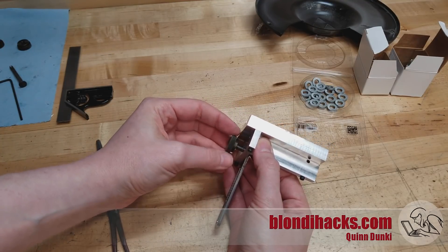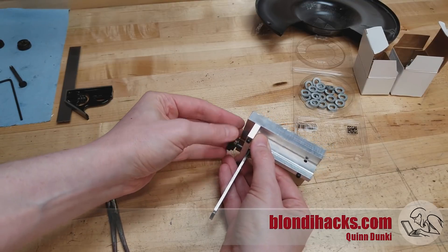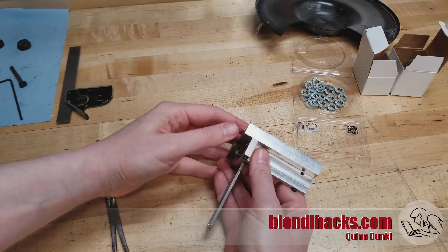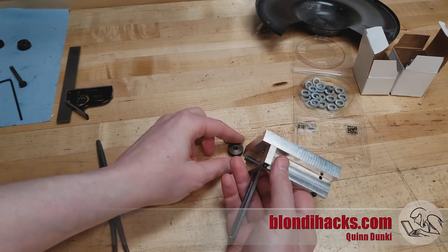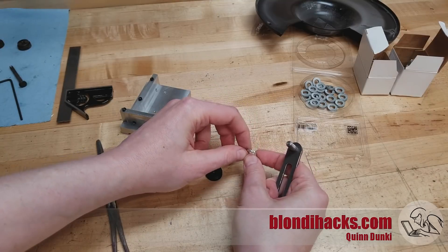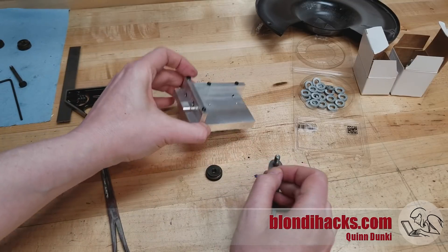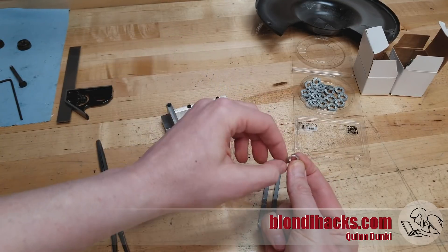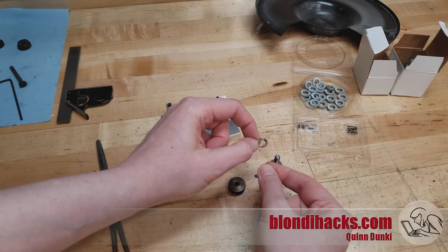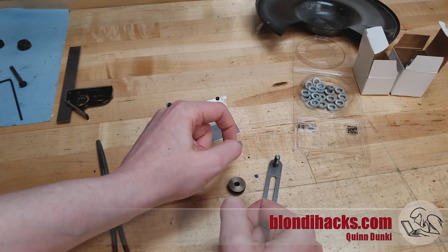I think what I need is once again a lock washer. I made fun of the factory lock washers, but this assembly is never going to come apart so I'll never have to fuss with those washers — all I'll ever do is loosen it slightly to adjust the platen angle and then tighten it again, so I won't be dropping washers on the floor. The question is what kind? There are a whole lot of kinds. Your basic spring washer — the problem is you have to get them really really tight or they don't work, and you don't have enough leverage with a little thumb wheel. These guys actually only start working once the bolt has already started working loose. So these are an inexpensive but mediocre option.